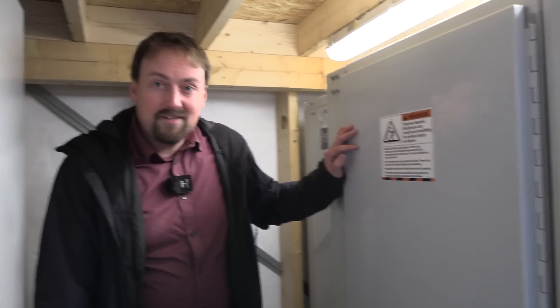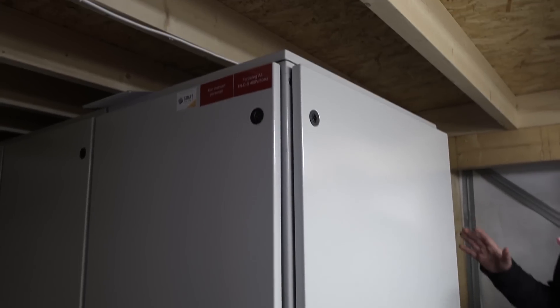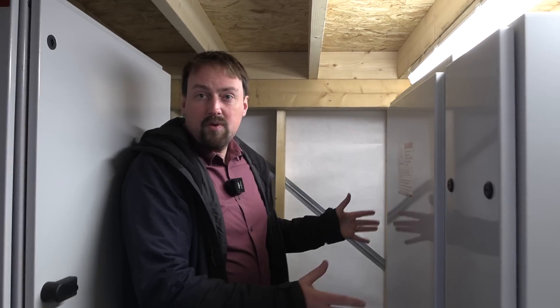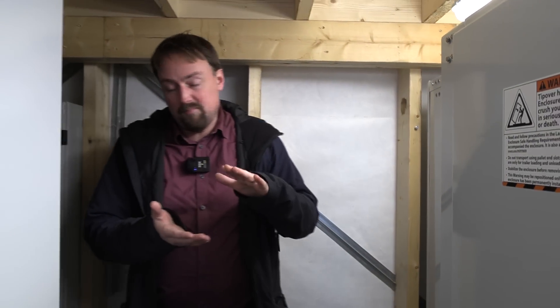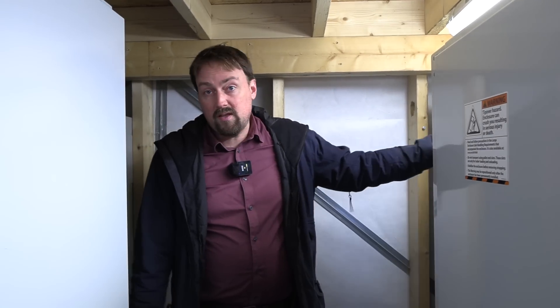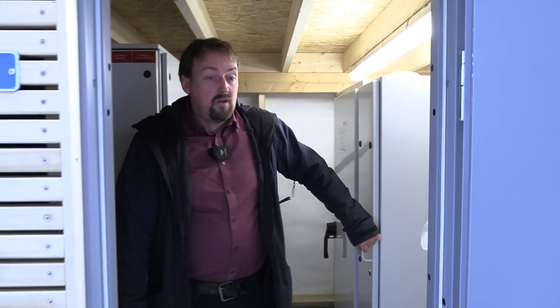Wow, that's really high frequency! This section here is just the power distribution from the grid — standard equipment powering our station and the DC chargers. In addition to the converters we have an air conditioning unit to handle the heat. Many people think there are huge losses across the air gap, but between the pads we are more than 99.9% efficient. The losses come from the power electronics — the same as conductive charging — which is why we need the AC unit at such high power.